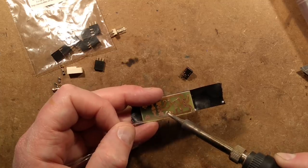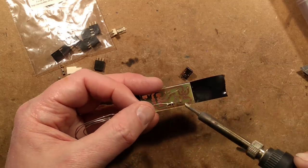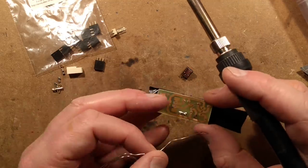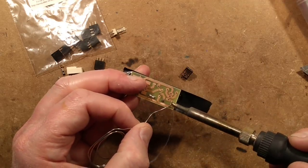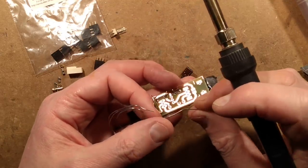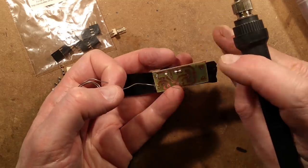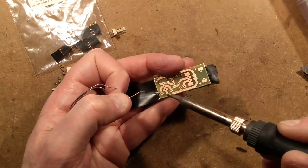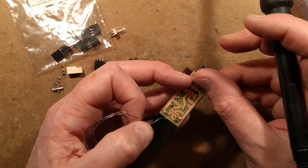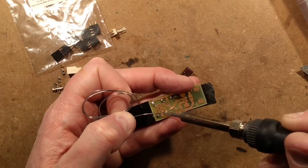The modern materials are less critical than they used to be. The sodium carbonate developer is so much nicer than the sodium hydroxide version. There was also the water glass version — sodium silicate, that sounds about right. It's quite an unusual material and makes a great developer for the original type of material, but for dry film photo resist, the best is sodium carbonate, which is fairly mild. Sodium hydroxide would burn your hands a bit — that's not good.